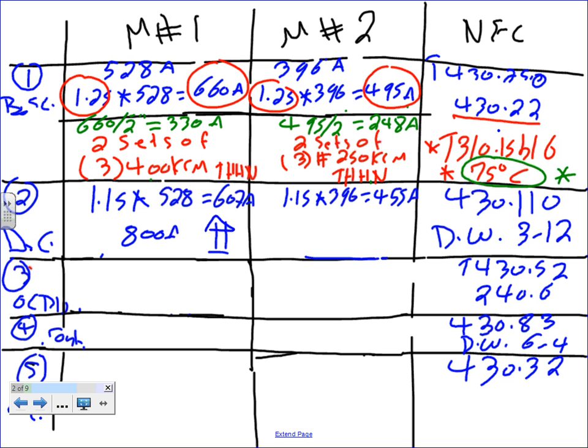Go up if it's not a standard. And this one would be a 600 amp. Go up if it's not a standard. Now remember, engineers are allowed to go lower. I can go up like here, 607, for 7 amps. I can go down to a 600 amp disconnect, sign off on it as an engineer, and say, you know what, I can put my neck on the line for 7 amps instead of going to the 800 amp. Can everybody get that one? Then they go hire another engineer when it blows up in somebody's face. It might never blow up. And then they say, well, you violated the code. Here's your license, they take it away from you.